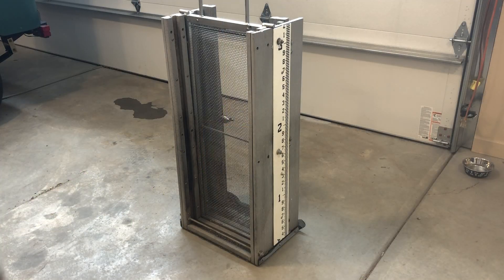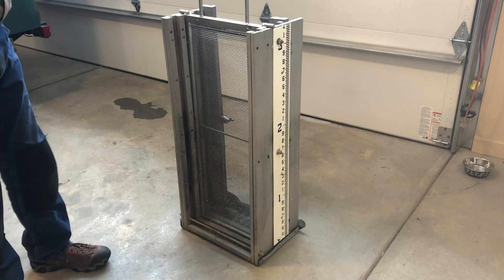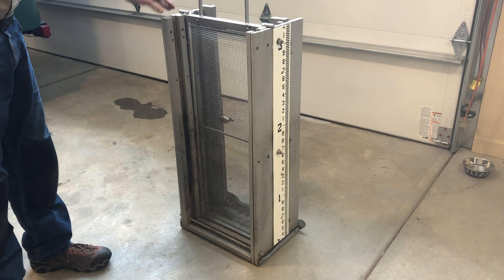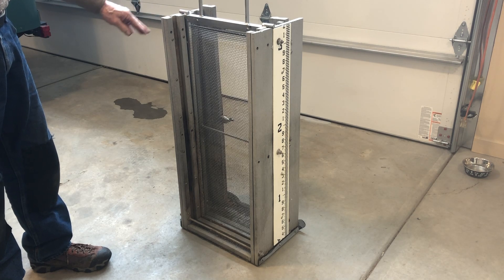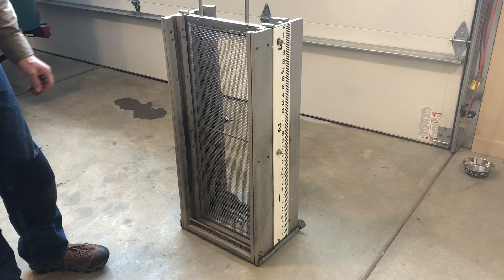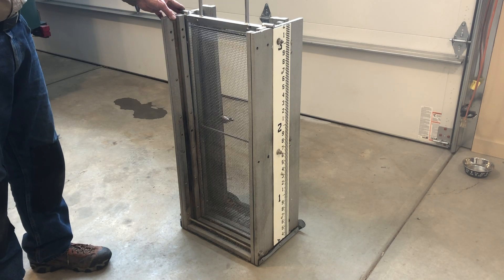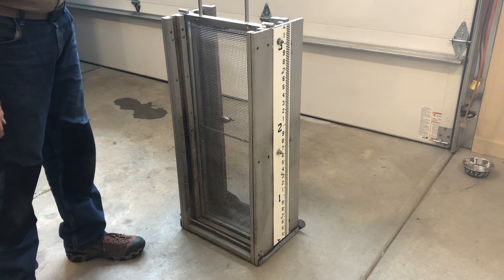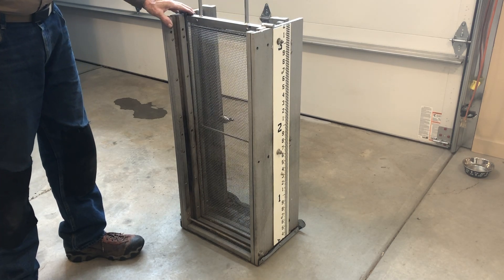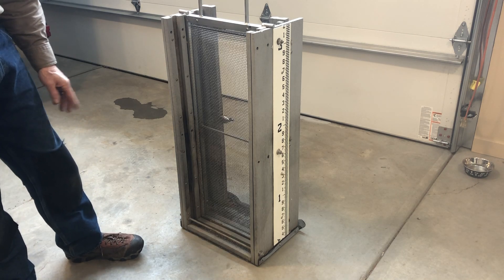This is a filter rack that I built for my ditch intake. I have a gate valve out on the ditch that this mounts onto, and I'll show you a picture of that. This rack assembly mounts onto that gate, and what I've done is I've made up some of these screens to filter the water before it gets into my pump.